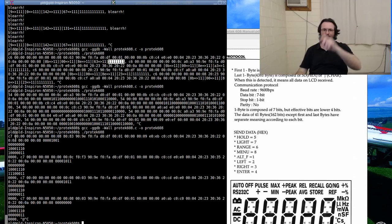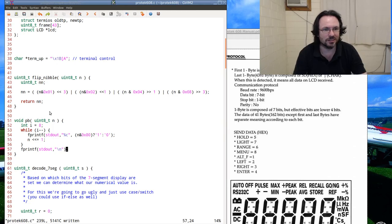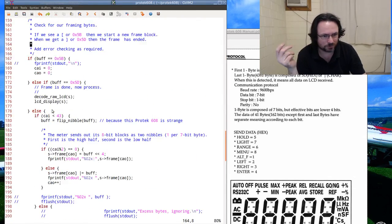I'm being overwhelmed by all my debugging. I need to go back, clear all the debugging out, start out with known figures and see what's going on. I'm fairly sure the problem is with the nibble assembly, and I'm clobbering it somehow. It's an off by one type error, either by the index or something like that, which means I do want to try one little thing. This is not going to work, but just so I can sleep.